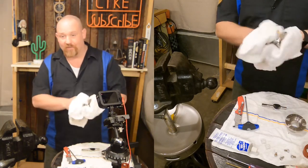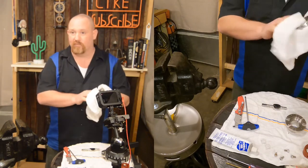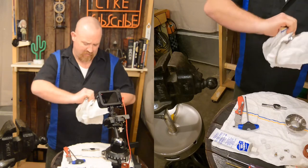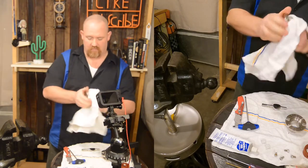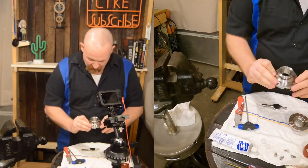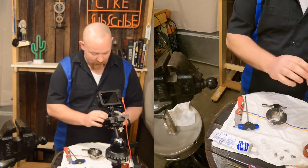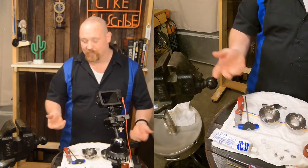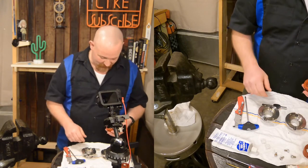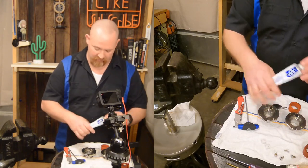Make sure to get down in that groove and try to get as much water out as you can. If you've got time, do a full PBW soak — let it sit, pull it out, scrub it, set it down, let it dry. Before I start putting it back together, I check the back side to see which side was on top before. I like to keep it that way — it doesn't really matter, but it's just a thing.